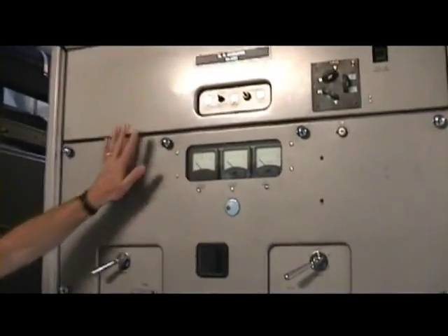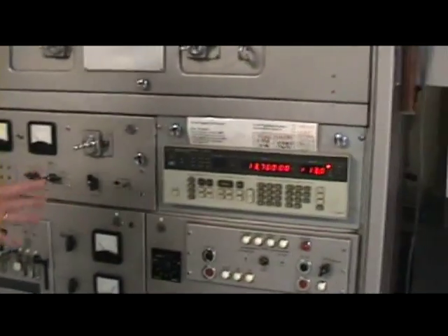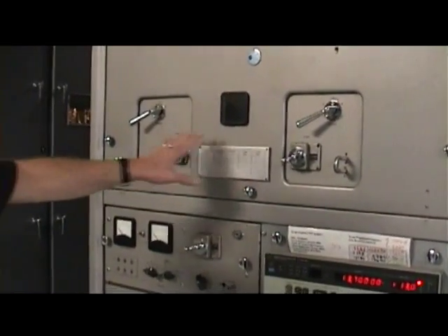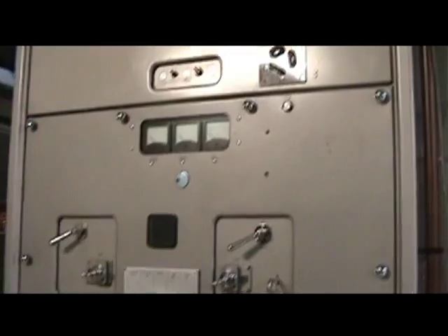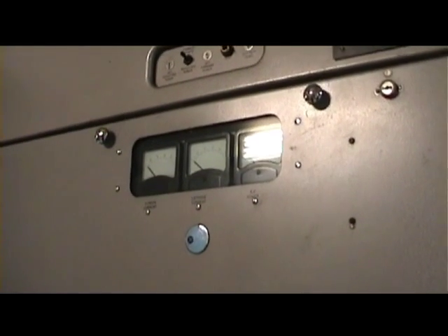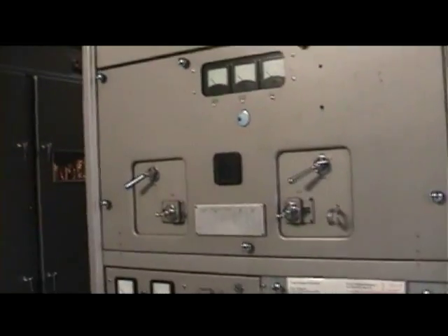The RF section needs five kilowatts of drive. Marconi's were always very savvy — they wanted five kilowatts, so let's see what they got. What they had was a five kilowatt amplifier, the H1100 — an absolutely bog-standard RF amplifier, much used by the military. One tube in the output, a wideband valve amplifier, with a synthesizer from which we can generate the frequencies we need. This one is set to 13.7 megahertz. Manually operated, tune and load, plate tune, plate load — quite standard design, up to five kilowatts out. This unit was available in various versions: AM with an amplitude modulator, frequency shift keying, CW as used here, or FM with various options. This was the basic carrier-only five kilowatt option — the H1100, air-cooled.